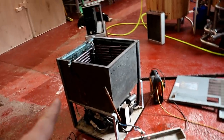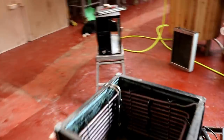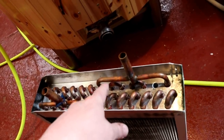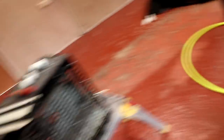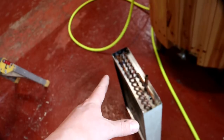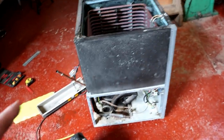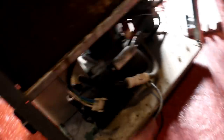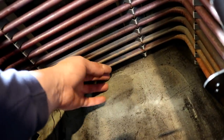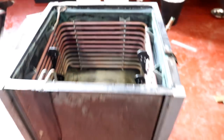I've brought forward the test before cleaning because when I sprayed some water in, it looks like we have a leak on one of these fittings. So potentially I've been lied to — this section may be no good. Hopefully I can just replace the radiator system; I might even be able to fix it with a bit of solder. The pump for the glycol tank definitely works — I saw it spurt a little bit of old glycol out. And looking down here, it's like ice cube to the touch, so it looks like the compressor works as well.